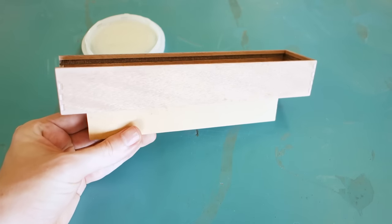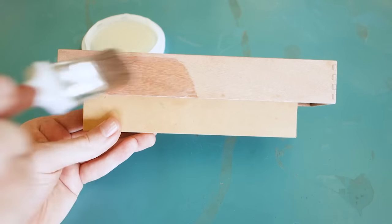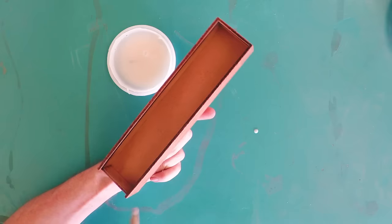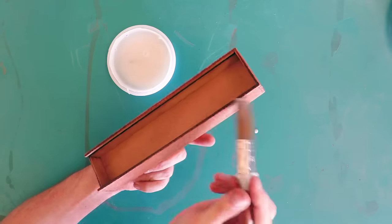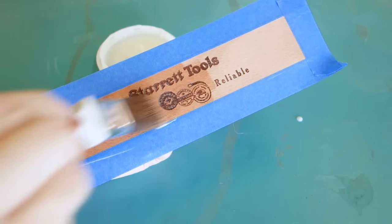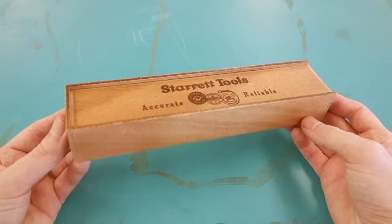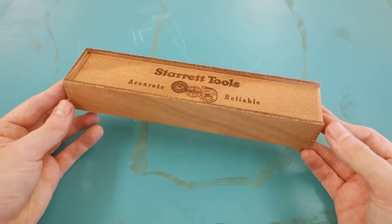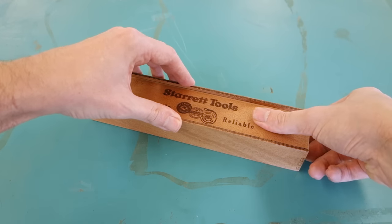So let's also give this thing a nice coat of varnish. It's not really required for a good box, but varnishing to give it a smooth surface will definitely kick it up an extra notch. If you do varnish it though, take care not to get varnish into the grooves to avoid gumming it up. For the same reason, I masked off the edges of the lid so there is no scraping of the varnish into the groove when opening and closing the lid. And that's about all there is! You now have a professional looking box with just a few steps of the laser cutter. Not only that, but if you followed all the steps properly you may just find that the box is a little bit magic.